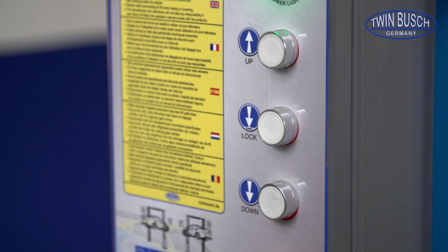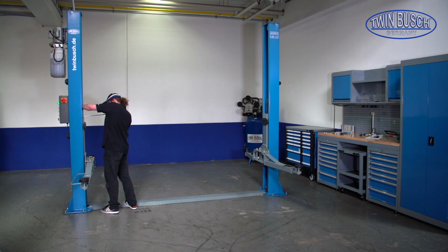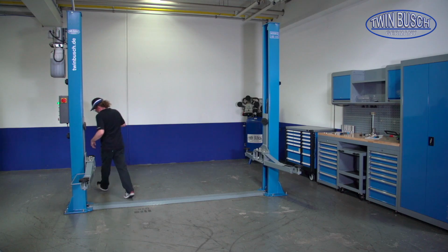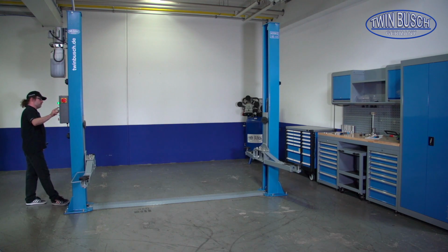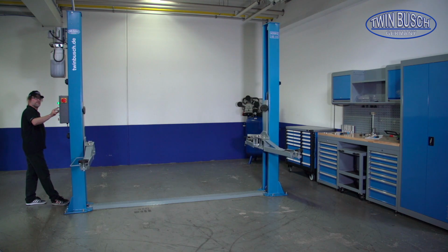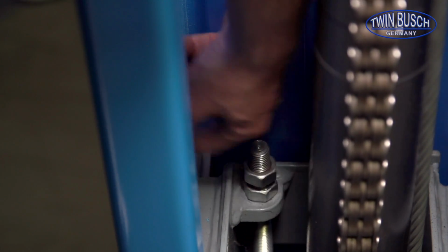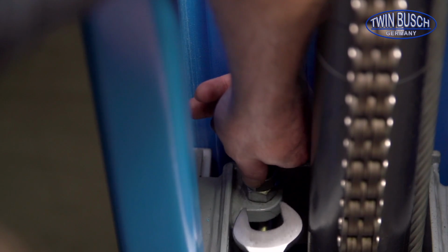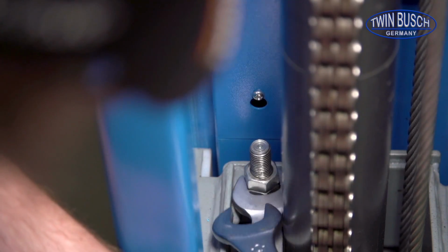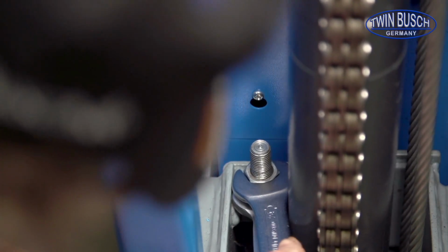Remember, before adjusting tension, to lower the slides in the next locking position using the hydraulic pressure release lever on the control box. When the locks click at the same time, the optimum cable tension has been achieved. Now take the wrench again, and lock the upper nuts on both sides. This completes the adjustment of the steel cable tensioning process.